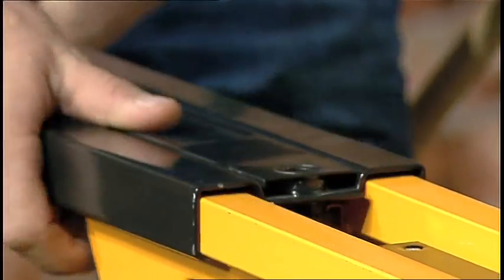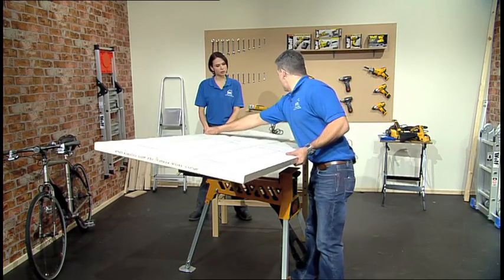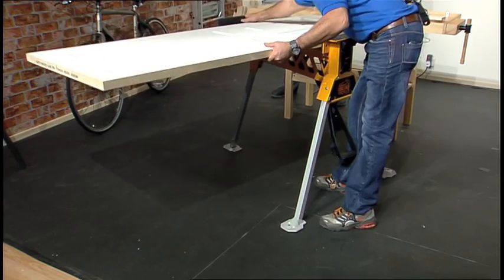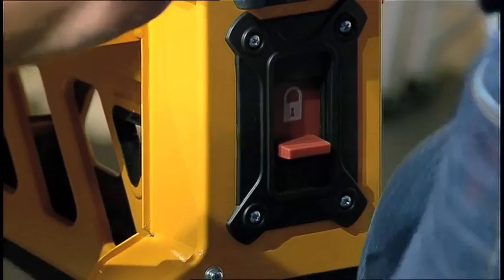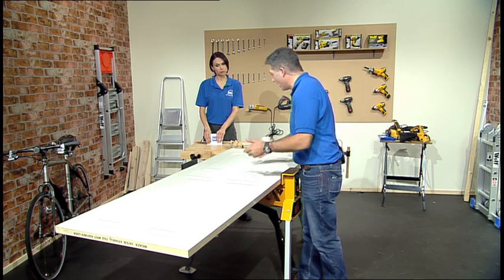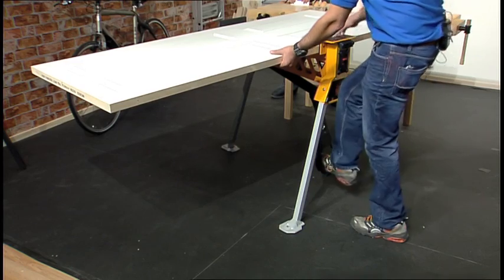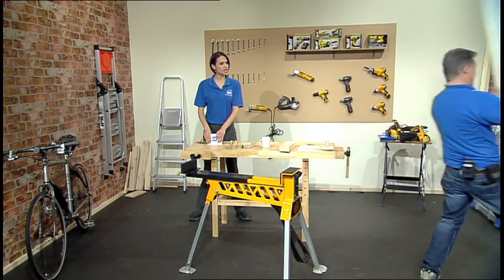And really quick and easy, I'll just flick that back again, take that off, and I'm ready to go. That was holding the door on edge. I can actually take this off, and if you spin it round and pop that in there, you're then able to pop the door down flat if you needed to. And that will fit in there — pull that, lock on, and tighten it off. It's great for sanding the door, painting the door. You could paint the whole top of the door, or sand it down, or work on it. Or even if you were putting two bars across there and clamping a door together because you're making a door. Very versatile. And released like that — quick release makes it even easier.